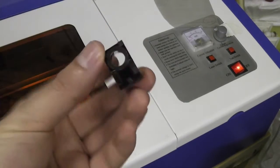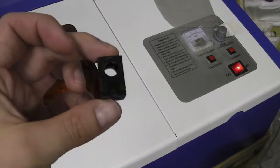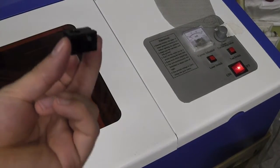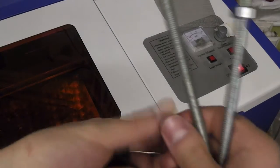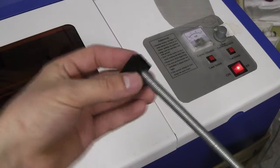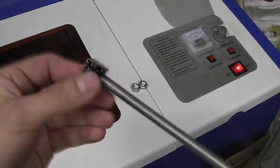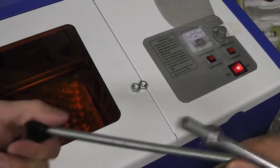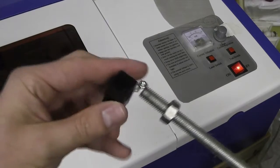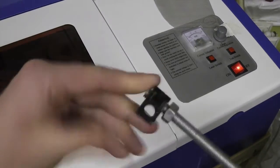What this is — it's just laser cut out of 3mm acrylic, and it's for holding two pieces of M8 threaded rod together. This is part of my x-axis build, and it's really more or less the only original bit which I had to design. It's for bracing in the same way that a RepRap is braced.